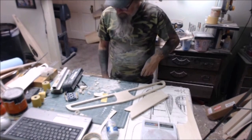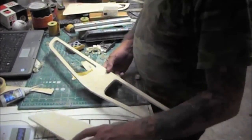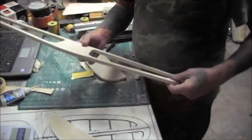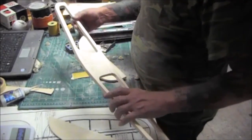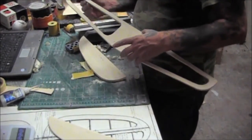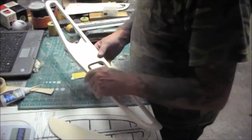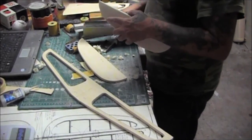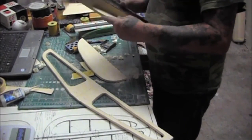So I'll probably go over to my wood pile and find the lightest pieces of wood that I have, and we'll cut the skins and see how much weight it's going to pick up, because it started at 2.5, and if it doesn't weigh less than 2.5, all this business of cutting it out was a total waste of time. If you add it back in with glue and all that, it would have been better to get a half inch piece and forget it. And I have had some good wood where a half inch piece would have weighed less. But that wood is hard to find anymore.